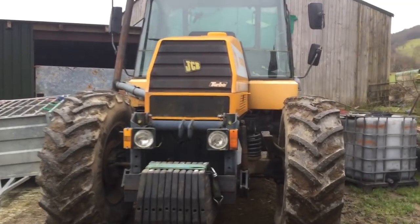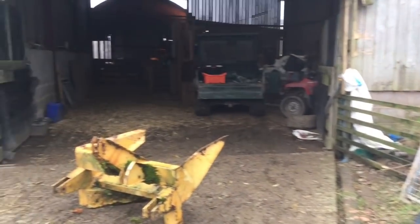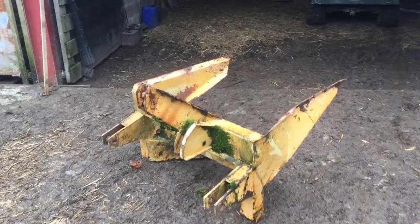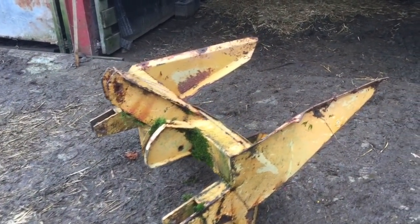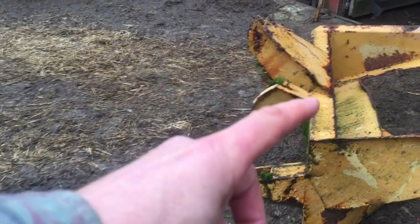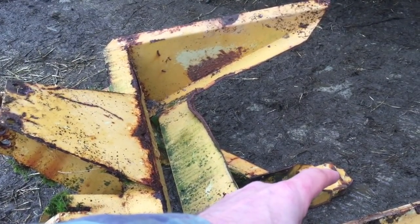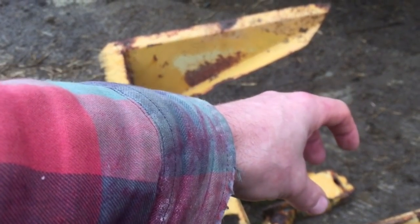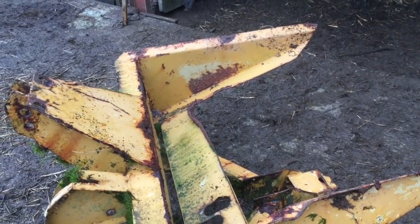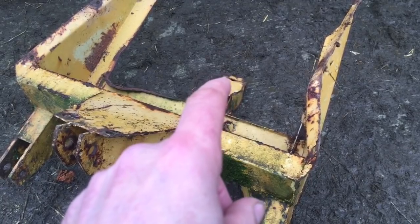Good tool as it is, and we are going to make that thing there, which is an old thing off a spreader. It's got a three-point linkage on here and here, but it's also got a hitch on there. I'm gonna put a ball socket in there to accept a small stock trailer — a 14 foot stock trailer. We're gonna cut these wings off here, put a ball hitch on there and make it secure.